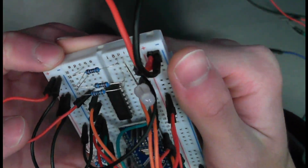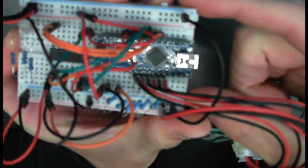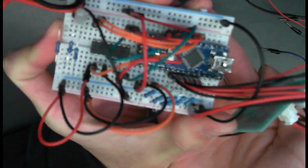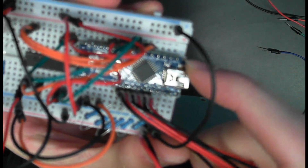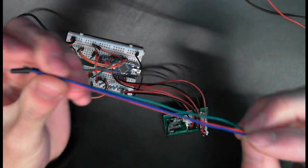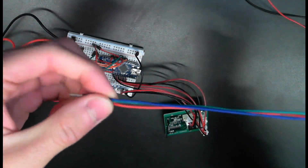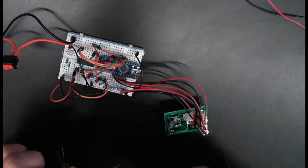Once those are in, locate the digital pins on your Arduino — in this case that's 10 through 12. It'll be these ones right here next to the USB port — the top corner. Those three will be your digital outputs from the Arduino. In your bundle of jumper wires, there are these convenient red, green, and blue jumpers. They're a little longer than the standard ones, and these are the perfect length to connect your LED.